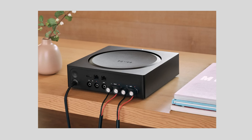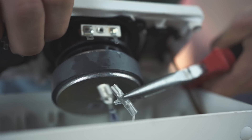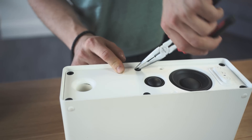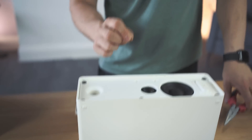However, I don't want to spend £400 on the Sonos Connect Amp. Now, obviously, what we could do is take this speaker apart and connect directly to the speaker terminals on the back. You've got a silk dome tweeter there and a little woofer there. But what we're actually going to do is solder to the DAC inside of here so we can get a low level out and connect RCA up to this.